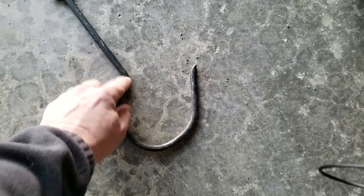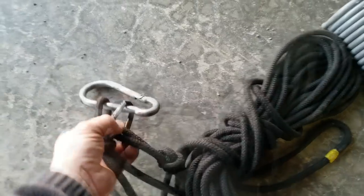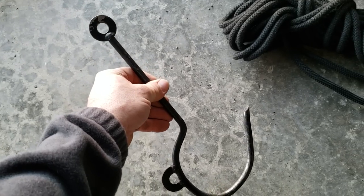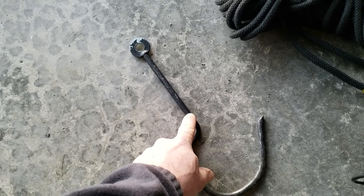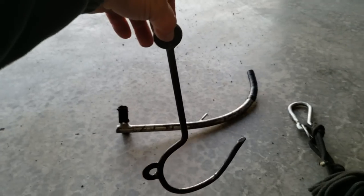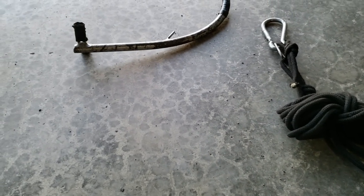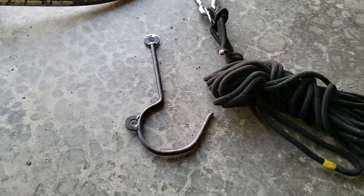I embedded the piece in the vise, heated it up, and bent it that way. The way it works: I've got a rope with two hooks — I use the heavier hook at the top to help hold it. It's not real heavy, so if there's quite a bit of distance from the ground it can sway in the wind a bit. You lift whatever you want to take up to the roof, pull the other hook, and it just unhooks — you can lay down torches, a vacuum pump, weight scale, refrigerant bottles, whatever.